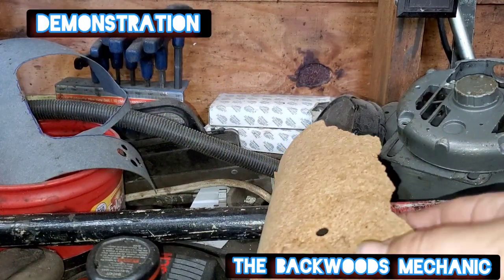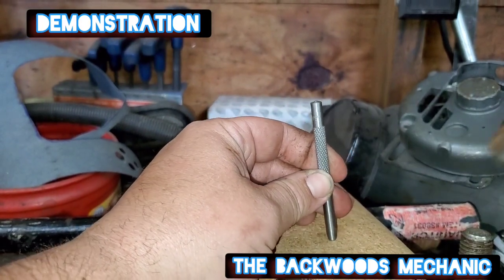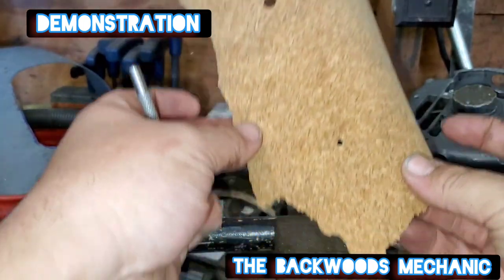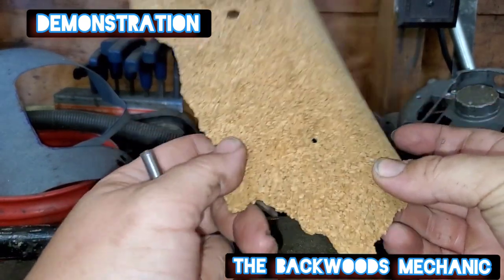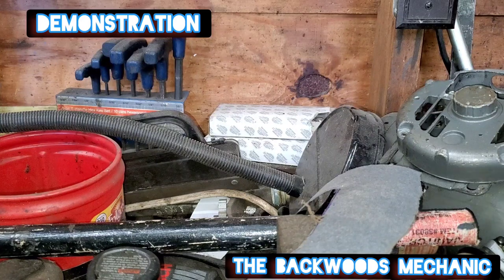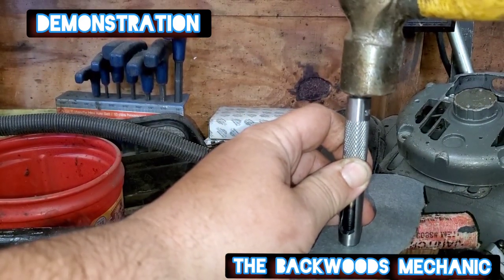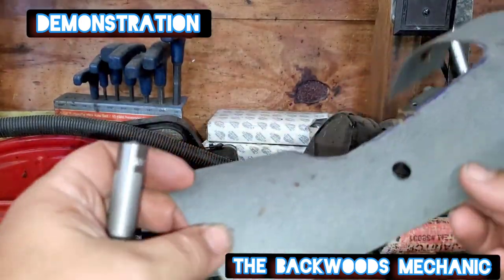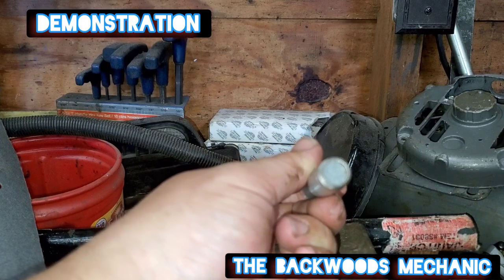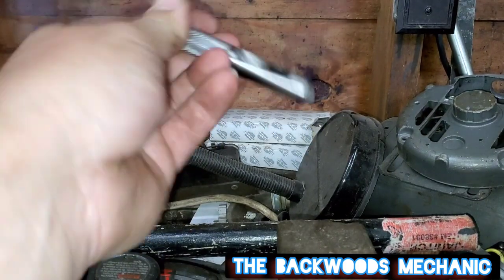Just for demonstrative purposes here, we're going to knock some holes in things. I've already hit one here - this is corkboard material. We're going to take the smallest one, the 1/8th. You set it right here, take yourself a little ball-peen hammer, put your fingers right there on the grips - voila, it knocks holes in it. Now, gasket material - let's go ahead and choose another one. This time we'll choose the 3/8ths. Put it on the striking cap, one good hit - right there's the hole. You can see it knocked a perfectly round hole in it. It puts the material right in the back side, and when you want to get that material out, you take it, run it down the flute, and just knock it right out.